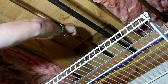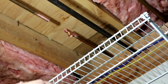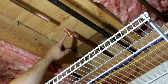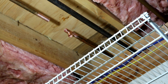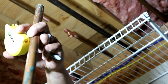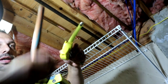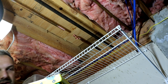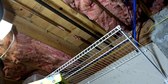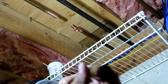Make sure you nest the fitting all the way — that's really important. Now we need to get a measurement from the inside of the T where the pipe slips in to the outside of the existing pipe, and that's how we'll cut our new piece to fit. The only thing you have to consider when picking up pipe for a job is to get the right type. Type L copper is for domestic water — drinking water, hot and cold in your house. Type M is for heat. Also make sure you deburr your pipes because cutting leaves a little ridge on the inside.